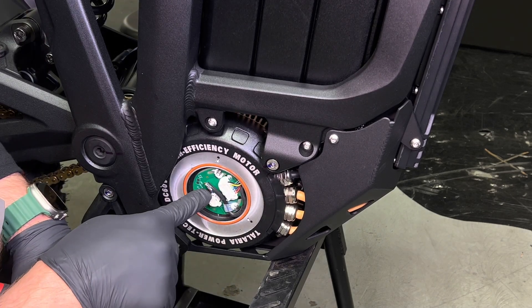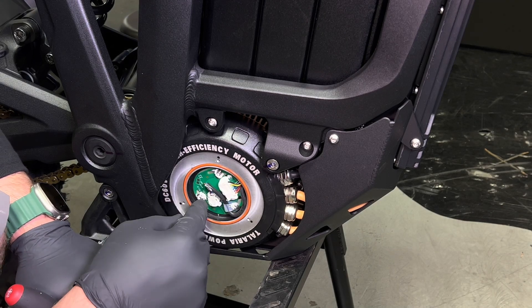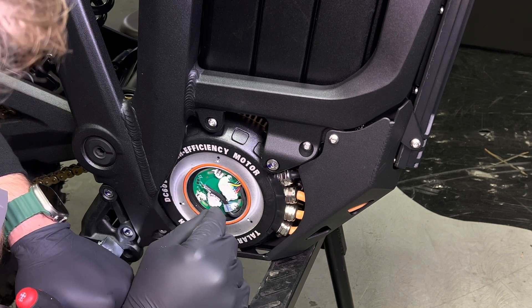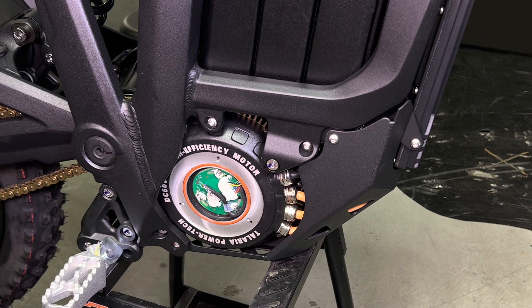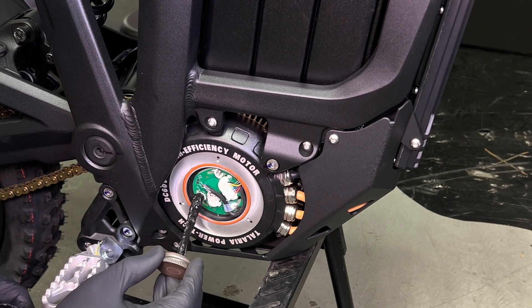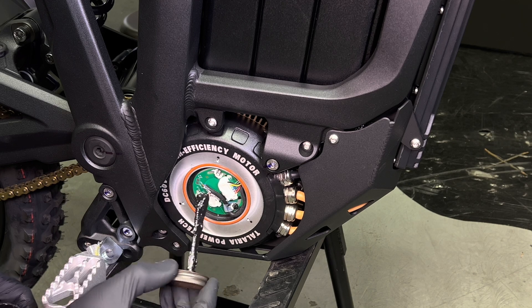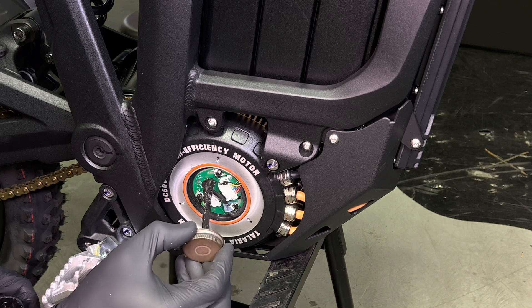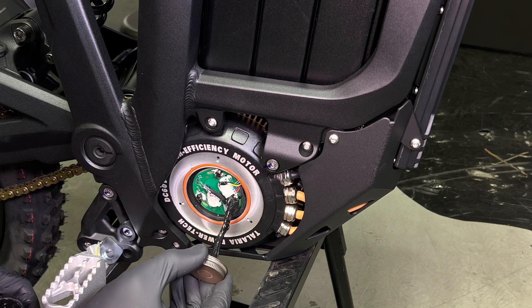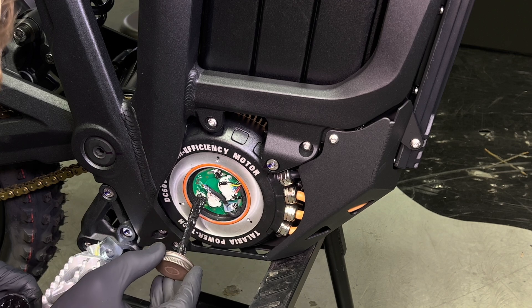Now re-add a little bit of silicone to the connectors and you can put a little more on top of the screws if you want. The factory does it so you may as well replace it. I'm using something called liquid tape — it's a mild silicone — just dabbing a little bit on each screw. We'll put a link in the description where you can buy this stuff; it's great for insulating wires. You don't really need this to look pretty since it's all getting covered up.